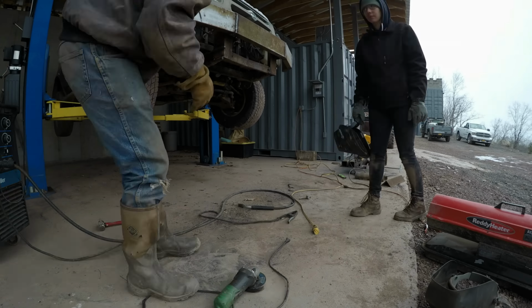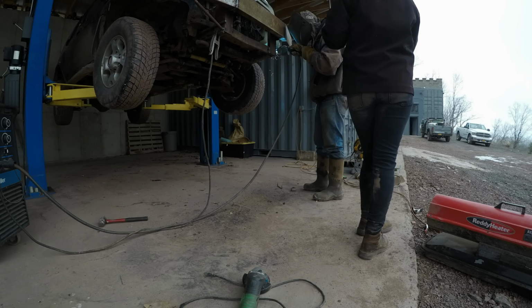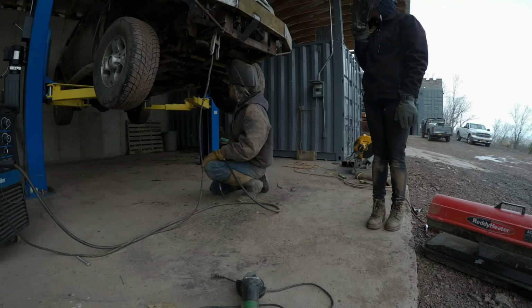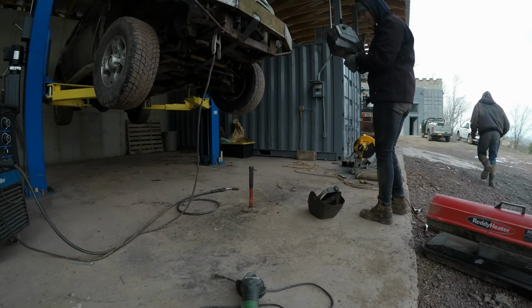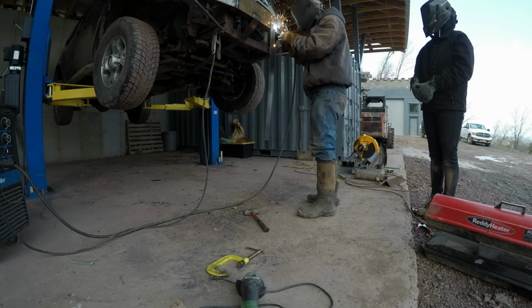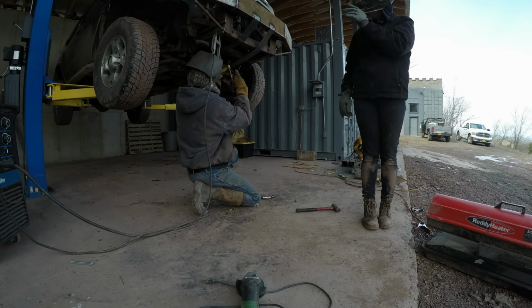Once the bumper is in place, weld on some skid plate bars. These are important to lift the vehicle over obstacles, instead of an obstacle getting caught and damaging the suspension. I found it is best to use individual bars instead of a continuous plate, because a plate can pack up bad with mud that can be difficult to clean.